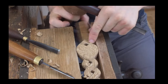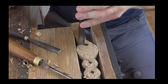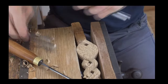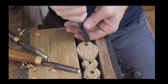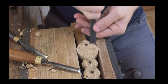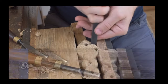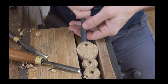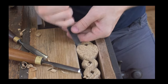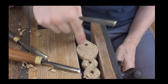We're just carving down on our stop cut because we've got some splinters left over that haven't completely come out. By carving deeper into the wood we're making our stop cut bigger and those little bits of wood that are left over we can cut away. If you're learning wood carving — if you have a little bit of wood that doesn't come away from your stop cut when you cut down — you make your stop cut bigger and cut further into the wood.